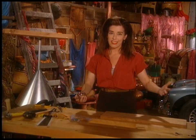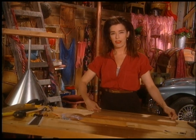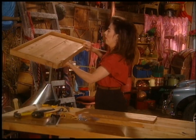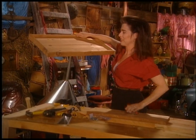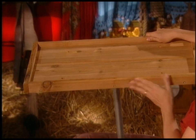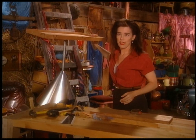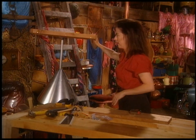Let's just keep them out of harm's way, because cats will get them if they're having to eat off the ground. So what I have here is a 24-inch long board — these boards are 24 inches long and they're 1 by 8 cedar, or redwood if that's what you can get in your area. The reason you use one of those two woods is because they're very weather resistant. They'll last about 20 years or so.